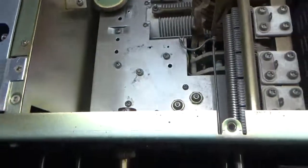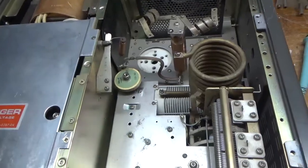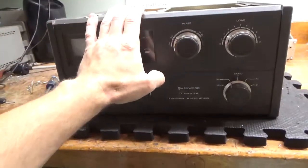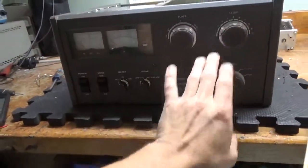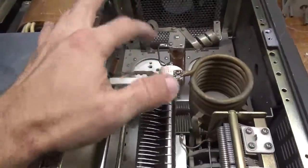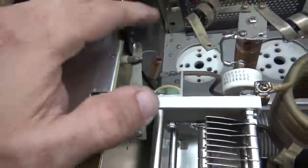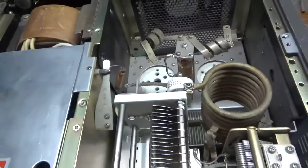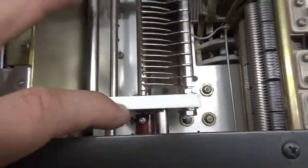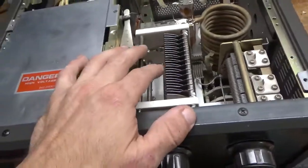I'm going to clean this out a little bit before I put the new one in. Okay, so it's all set. Got the front panel reinstalled, knobs reinstalled, resoldered the connection at the coil, reconnected the connection at the plate choke — left those disconnected as I'm going to take the cap out and do the other mods after this. Tightened up the coupler screws. Make sure the plates are nice and clean, no dust or anything.